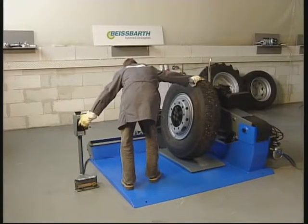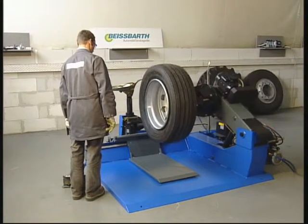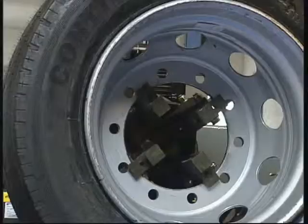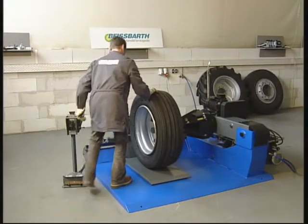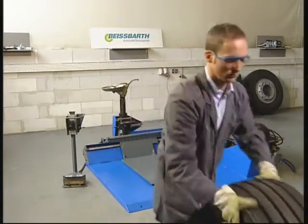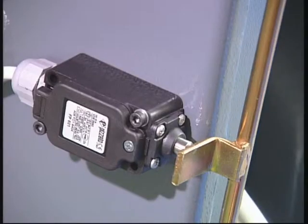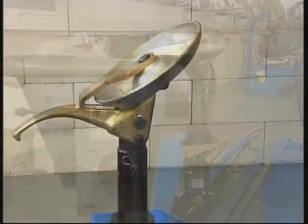MS75 SA. This equipment has a working range for rim diameters from 14 to 52 inches, tire diameters of a maximum of 2,300 millimeters, and tire widths of approximately 1,300 millimeters. It is reliable, robust and quick. The all-round mounting machine for simple truck and bus wheels, as well as for wide tractor wheels of small central bore, or wheels for special earthwork vehicles.